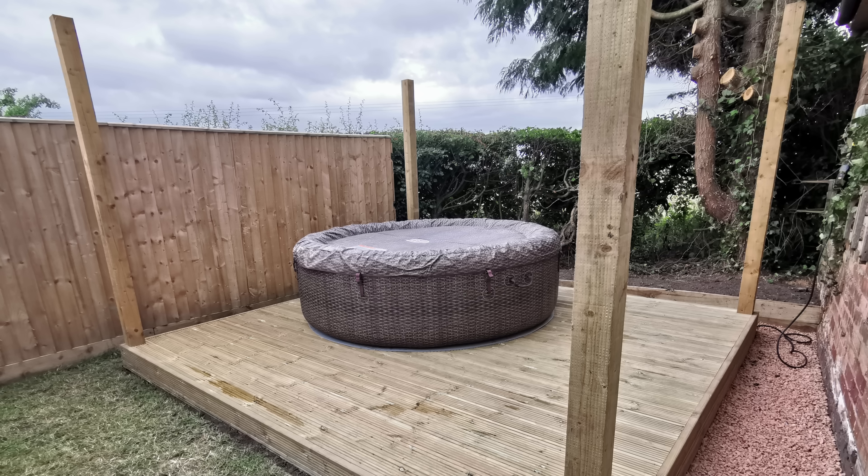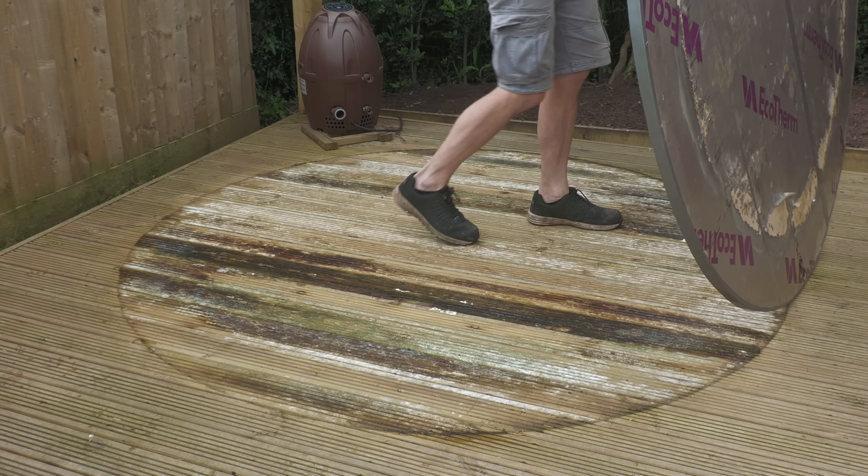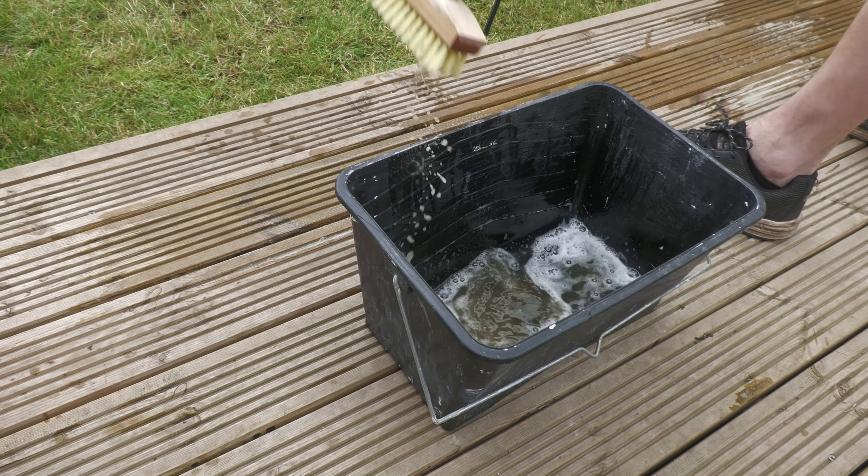There are lots of elements that go into a successful long-lasting decking system — not just the decking planks themselves, but vitally important is that substructure. A lot of people said I'd put my decking planks the wrong way up, but my deck planks have grooves on both sides and the underside has a manufacturer's stamp all over it, so they've clearly been designed to have that castle structure on top.